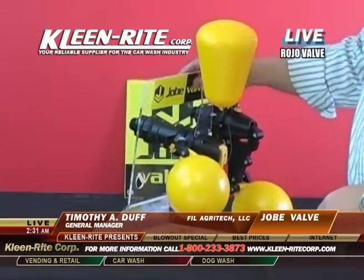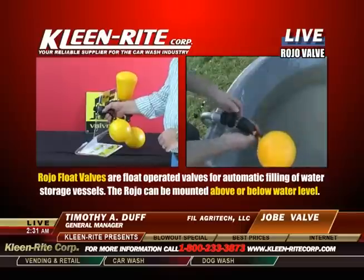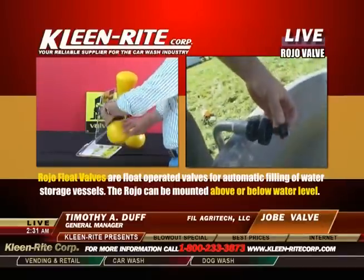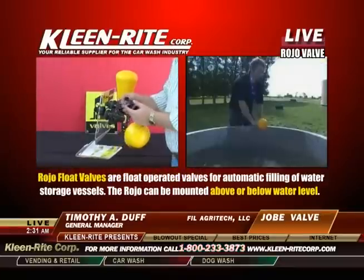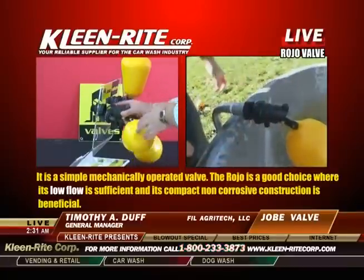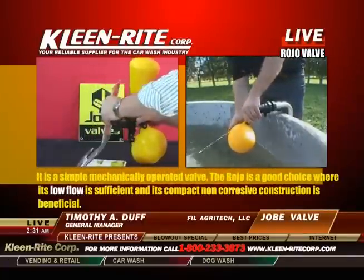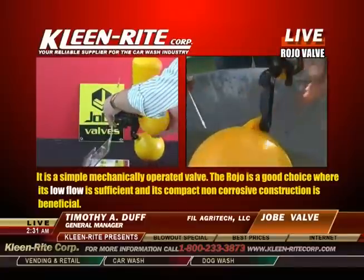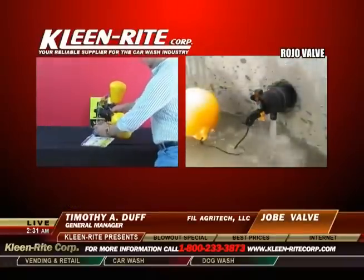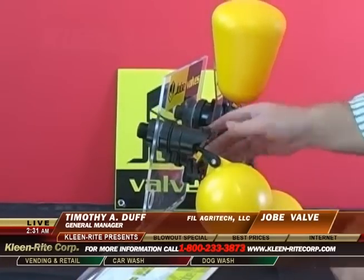The last valve is the Rojo valve. The Rojo valve is a bit different in that it's a much lower flow valve. It still has a detach feature where it can unscrew to easily access the filter inside. If you get debris inside the filter, simply clean it out — when the valve is disassembled, the water shuts off automatically via an internal check valve. Simply put the valve back on and it's ready to go. The Rojo also has a convenient lock off switch — push it in to hold the float up in the off position, or pull it back out and the valve is ready for service once again.